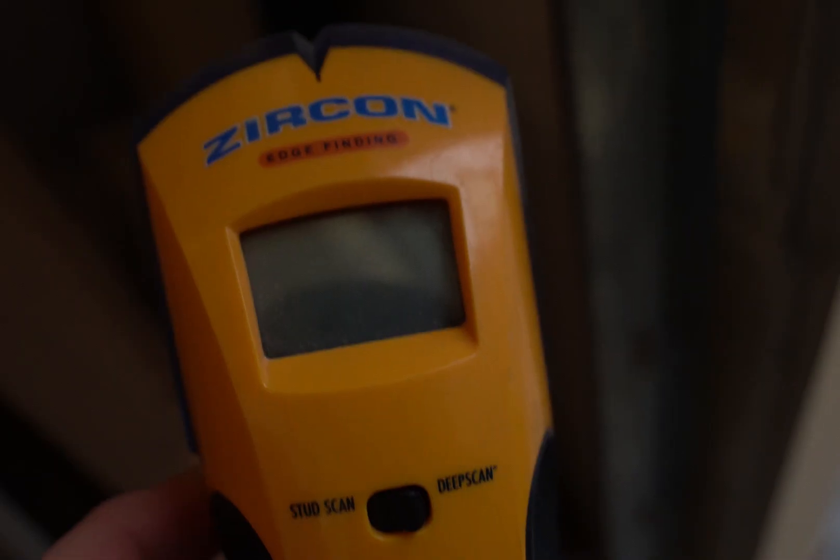So that's the spot on the outside — here's the spot on the inside. I've got a stud finder here that can also sense electrical and other things in the wall, and I'm just going to make sure I'm not going to hit anything I don't want to. I do have a stud right there — the stud sensor's finding it, and I can also see it because there are little screw marks and tape running up here. The only thing I'm picking up is the structural studs, so we should be good. I can go ahead and drill my hole down here and a hole up there, then run the cable and pull it out without tearing up too much.